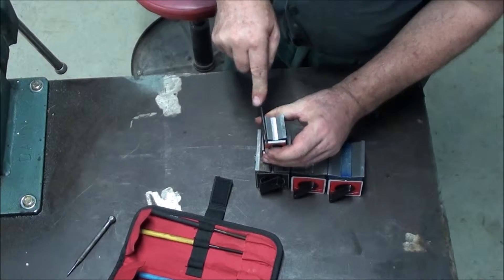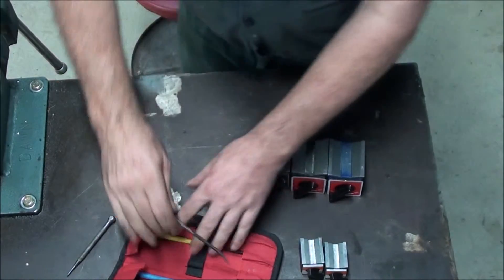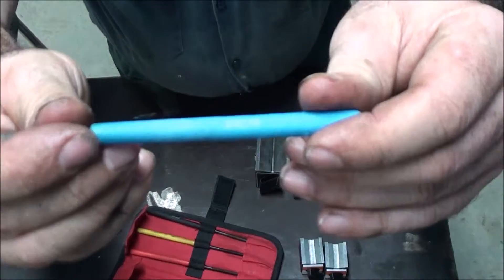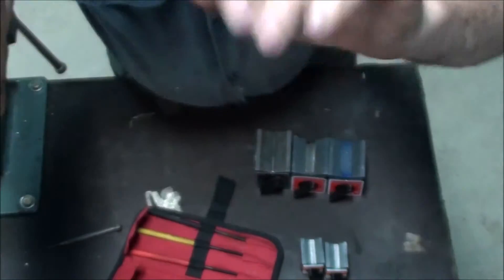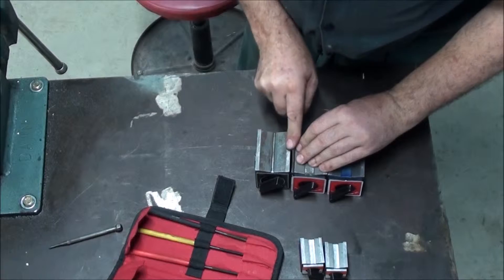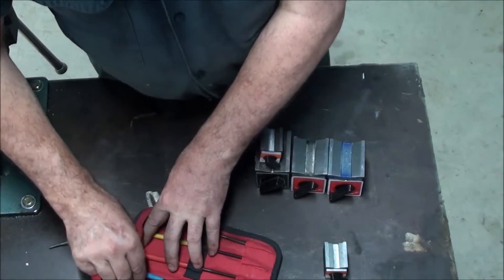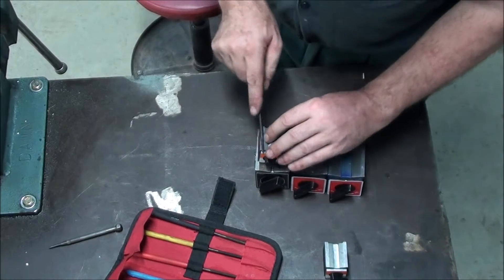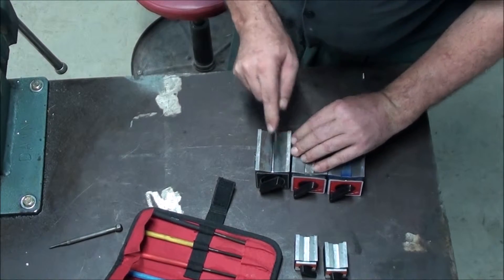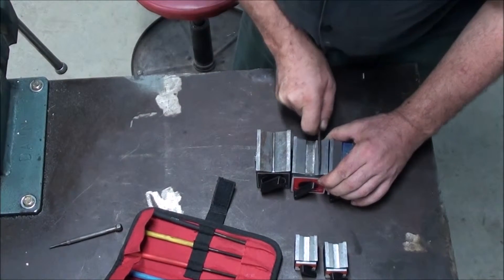I think these will be soft. 55 cuts that, 55 cuts that - it cuts that, so we're going to make another jump. By rights you're meant to go down one step at a time. This one here is 50. 50 cuts that quite well, cuts that quite easily, cuts that quite easily. Now I'm expecting these to be soft. 45 marks that up, marks that up, and gets into that quite easily.